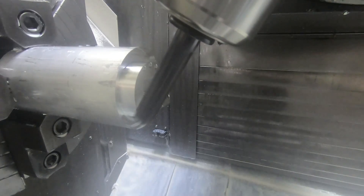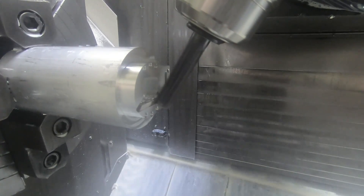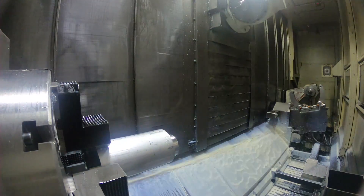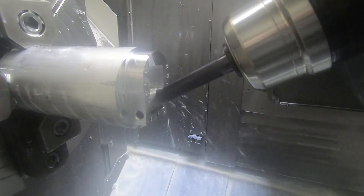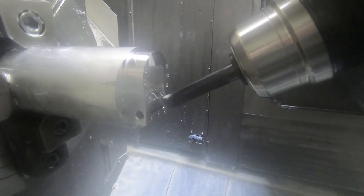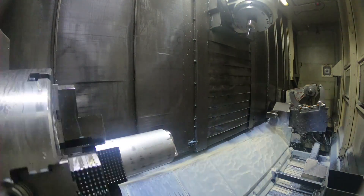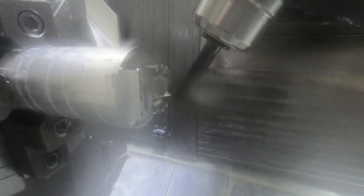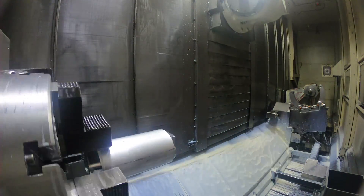This is a three-quarter inch end mill with a one-eighth inch tip radius to do the angle cuts on the inside of this cavity on the front of this thing. So I rotate it for each one of the four angles — the two sides were the same angle, and then the top and bottom cuts were at different angles.